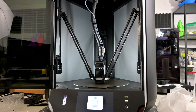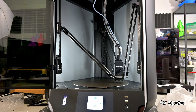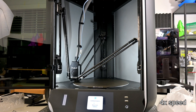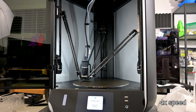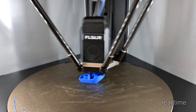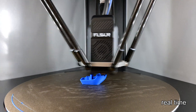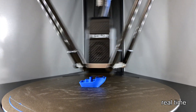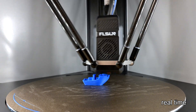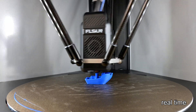The S1 Pro is a Delta 3D printer, which has three pillars with separate motors. A belt-driven carriage is attached to the linear bearings on each pillar, and each carriage has two carbon fiber forearms which link the carriage to the hotend effector. By controlling how the carriage moves up and down, that determines how the hotend can move. Because the motors are stationary, the rest of the carriage and hotend assemblies can be extremely lightweight, allowing for very fast print speeds. With three motors working together, they can achieve extreme accelerations of up to 40,000mm/s². The Delta style also allows for the bed to be stationary, increasing stability of the printed parts.